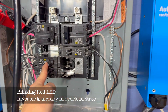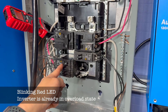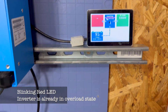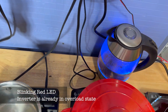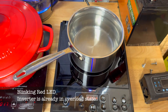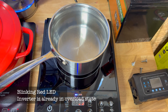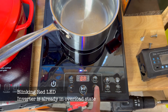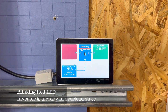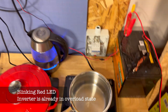Now we're at 11 amps on the neutral bus. Let's hit another load, which will put us over what the inverter is rated for. This inverter is rated for 8,000 watts continuous at 20°C, and it's already warm in the garage since it's close to summer. We turn on the second induction cooktop, ramp it up slowly - low heat first, then gradually increasing to 212, 260, 300 - hovering around 10,500 watts with only 5 amps on the neutral bus because we're balancing the loads.